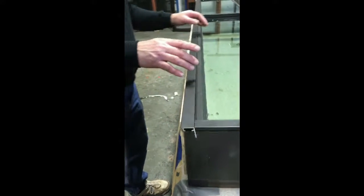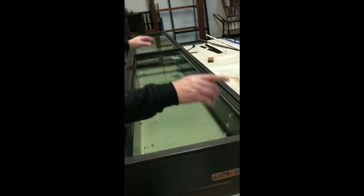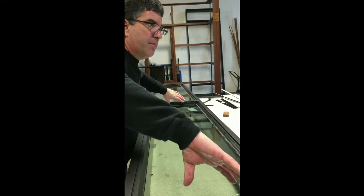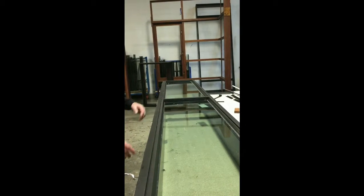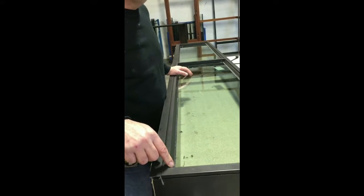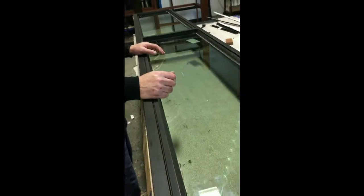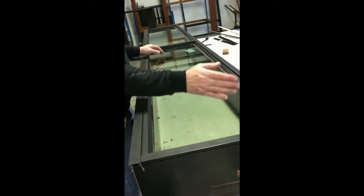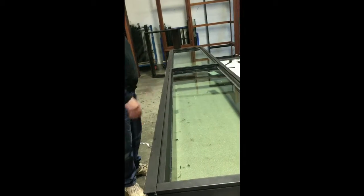It varies. We're going to cut this piece of metal right here, put that in, then put this in, and we've got two compound miters to put these on. This is 15-5, this is 17-5. So what we do is we cut all the tops at 15-5, then you come back at 17-5 and cut that one.